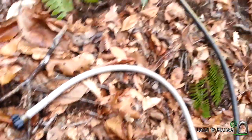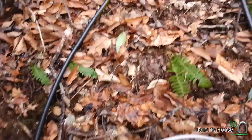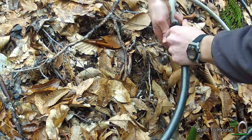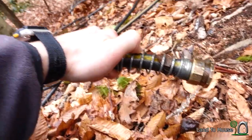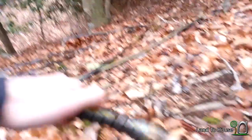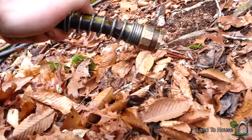I've got a 100-foot hose that I'm going to attach here and see how much further up the hill until this water stops flowing, because we want to know exactly what pressure equalizes down there. I waited until this hose filled up with water, and it's still coming out. We're about maybe five feet higher than we were just a second ago, and water is still trickling out, so we're real close to the cutoff spot.